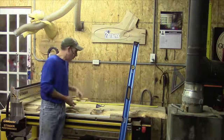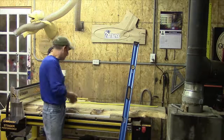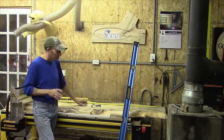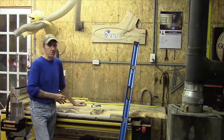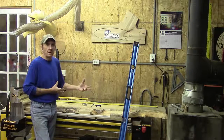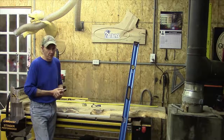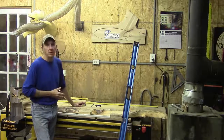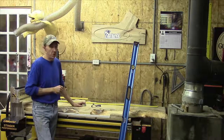The reason I do that is because I'm programming my scenes that go into these slabs at 48 inches. It leaves me an extra inch on each end of the Y axis just as a little precautionary safety measure so I don't get an over travel alarm. We've blocked it in place, and there's a safety issue here — you're dealing with a 50, 60, sometimes upwards of 100 pounds piece of material. You don't want this coming loose.